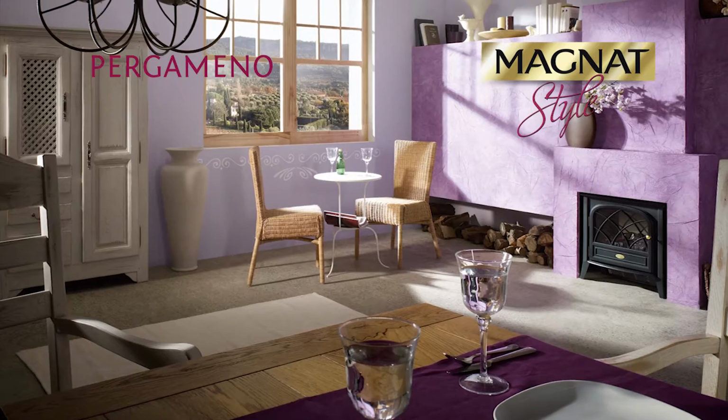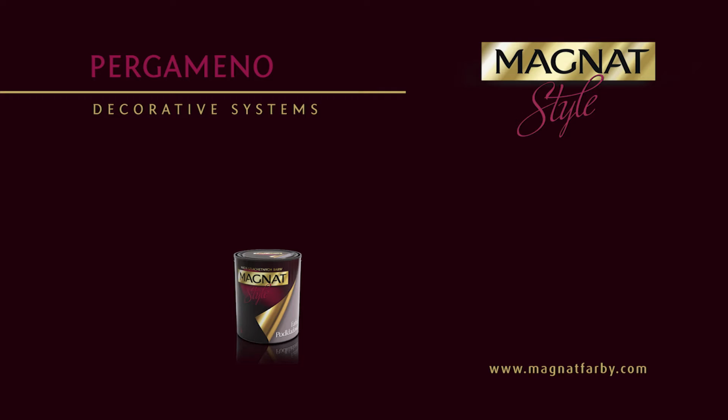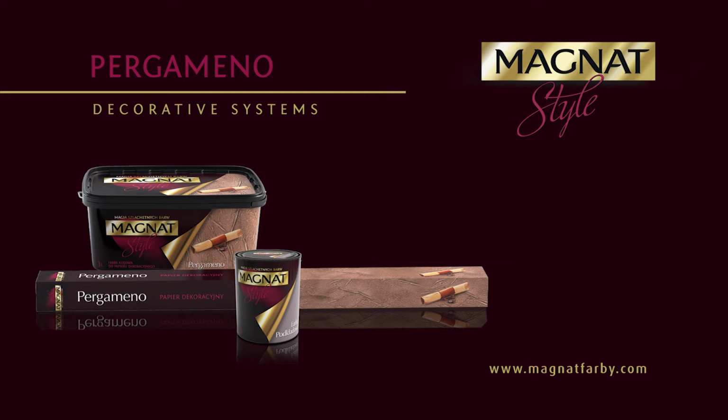Application of the coating requires the following products and tools: undercoat, an acrylic paint for proper substrate preparation; MAGNAT Style distemper, an acrylic paint for binding and curing the MAGNAT Style pergameno texture; pergameno, the decorative paper; rustic top coat sealer, a matte acrylic sealer for the coloring and protection of the pergameno coating; coloring pigment, a concentrated pigment for coloring MAGNAT Style products; a sponge float.